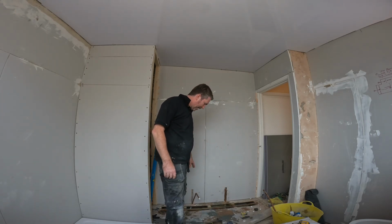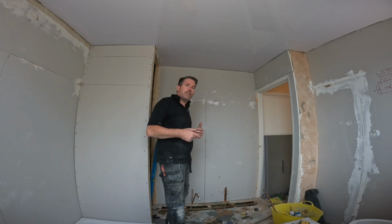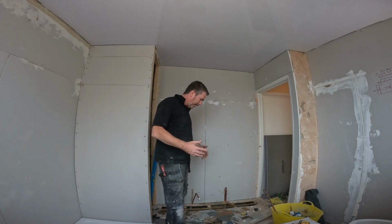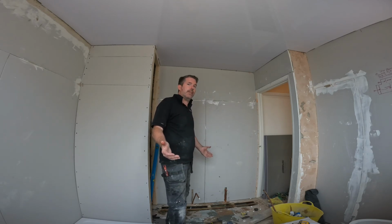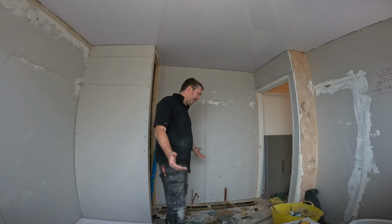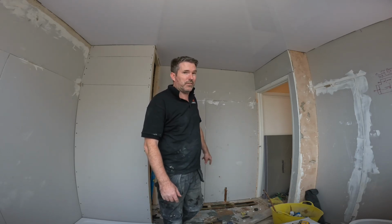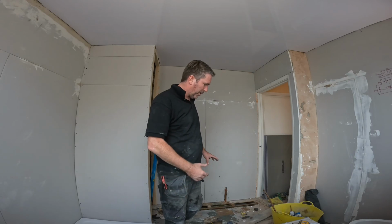Before I nail them back to the wall and fill them in, I'm just putting the heating on and firing it up, making sure it gets warm, and then I'm going to turn it off, make sure it gets cold, because if you're going to have a leak, that's when you're going to have it. Do you know what I mean? It's not going to leak now, the heating's cold. So let's fire it up, make sure we haven't altered anything, make sure another fitting's not gone, before we put that bit of floor down.